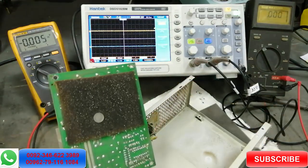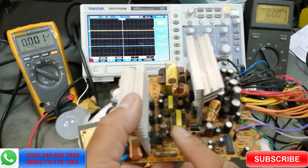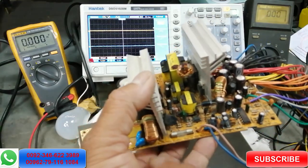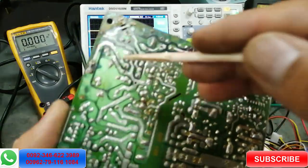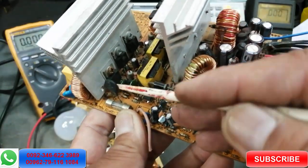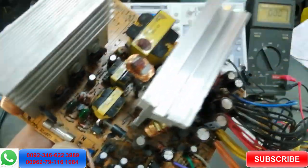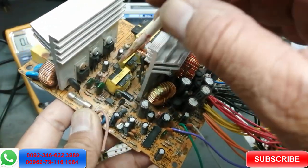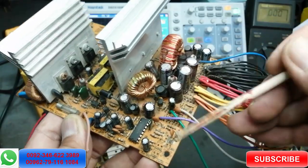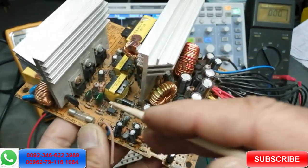I removed the cover — it is a branded power supply, very nice. In my last tutorial we discussed this type of supply: there is the input voltage section, filter circuit, diode rectifier, rectifier capacitors, and after the capacitors a standby circuit. The standby circuit has some resistors, a transistor oscillator, and a transformer. After that we take the 5V standby output at these capacitors.